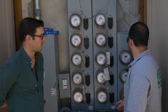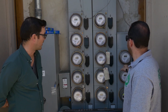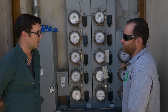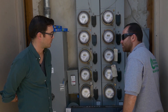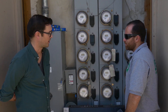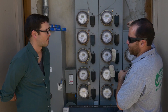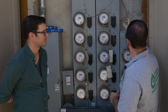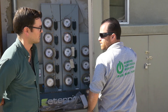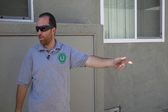These panels look like they just recently upgraded. These meters can all handle at least about 125 amps minimum, and you're only at a 60 amp circuit. So what we can do is upgrade the main breaker to 125 amps. From there, we can install a small sub panel for the vehicle and put a 50 amp circuit breaker. From there we would punch out on the side somewhere, or maybe go across through this cabinet, come out from the bottom and get across to the garage somehow.